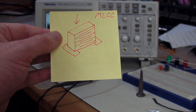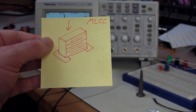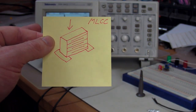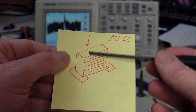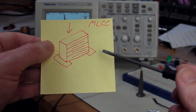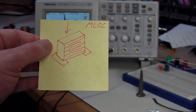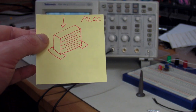It'll be a piezoelectric material like this, essentially like a capacitor, but it's tuned for a flat response, a flat shock response. But multi-layer ceramic capacitors can have exactly the same effect. It's not nearly as linear, but it can certainly generate some high voltages, and it works both ways. If you apply a shock or a vibration into the capacitor, it will generate a voltage, but likewise, it will also generate sound output if you input a specific frequency at a high enough level. It will actually generate a sound, or what's called singing. These capacitors will actually generate a noise. So it works both ways.